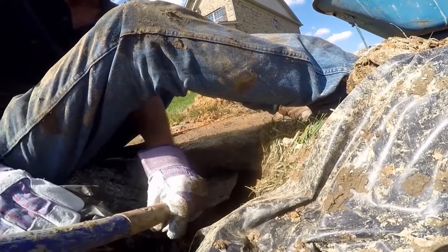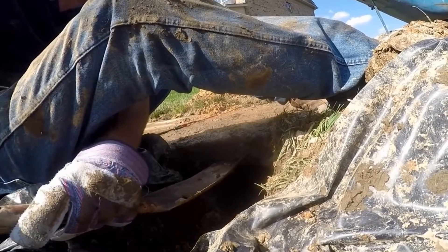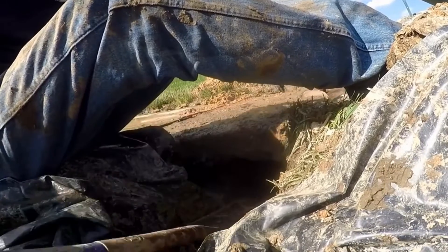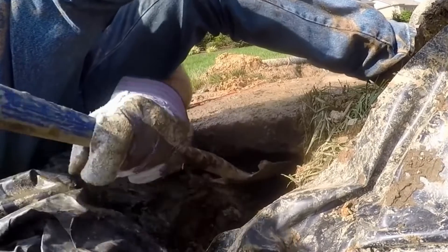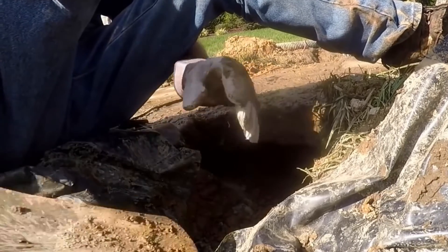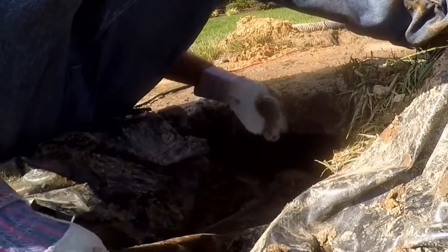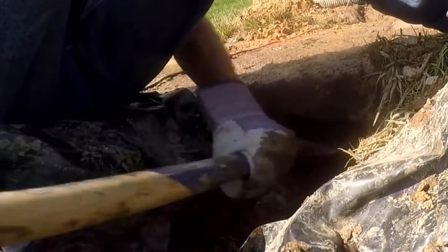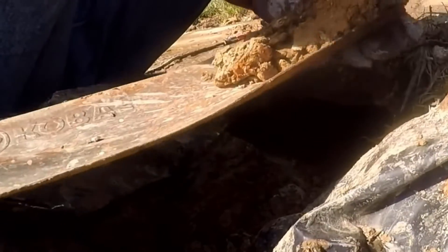About the best way to tunnel that I know of is to dig yourself the trench. Then you can take your small spade shovel. What you're doing is you're scraping at the top of the sidewalk — push it down, pry it down, and then come back and pull out the dirt. It takes a little bit of effort, but once you get into it, you've got it. Take some from the bottom. It doesn't come out in big pieces, but it does come out. Twist your shovel, pull out your debris — you can see it's not a lot, but it does come out.